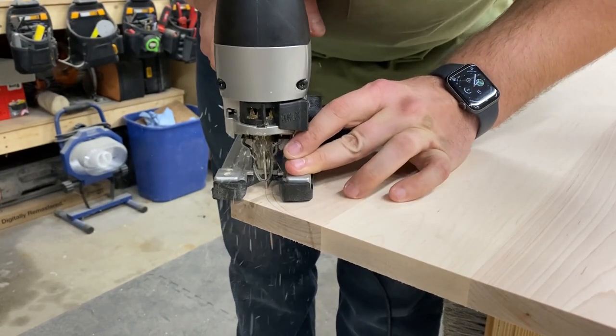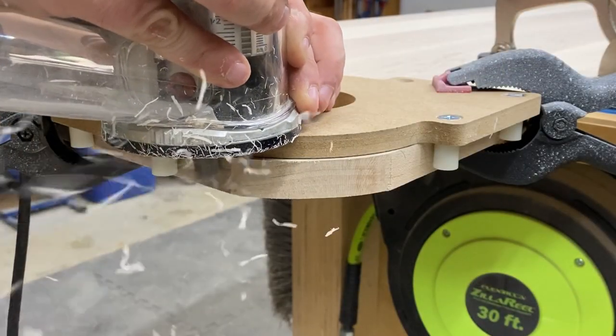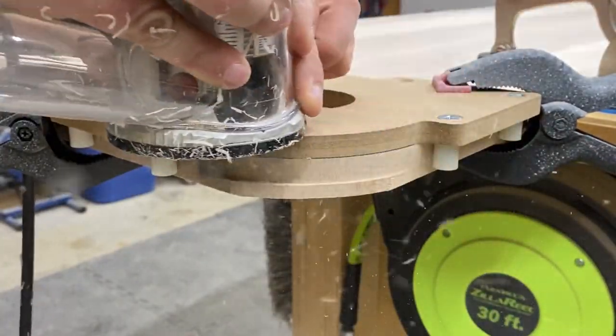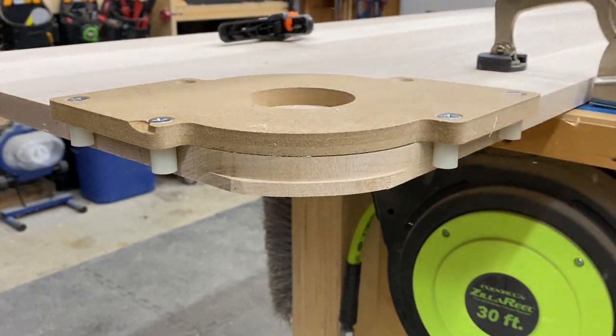The corners of the headboard get the same radius treatment as the header and footer rails. I first trim the excess with a jigsaw, and then use the same routing procedure as earlier, but this time, I use a jig with a 3-inch radius for a more pronounced look. There is something just so satisfying about a well-made jig and a flush trim router bit.